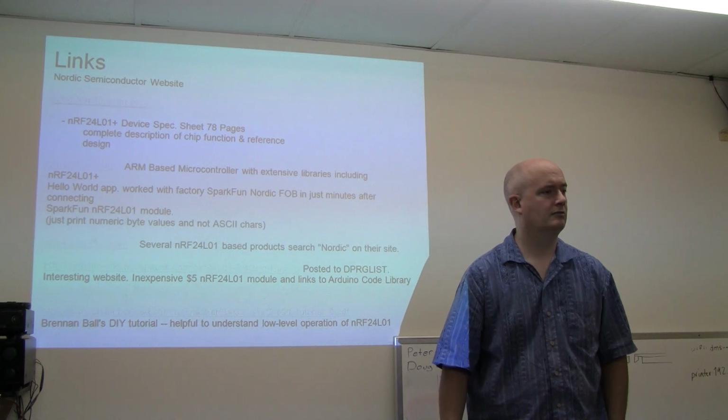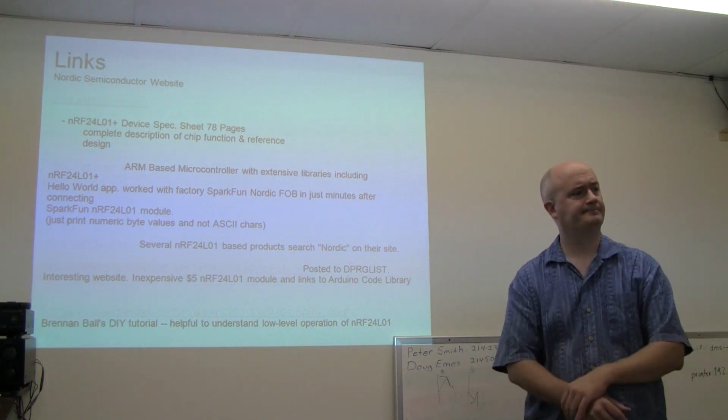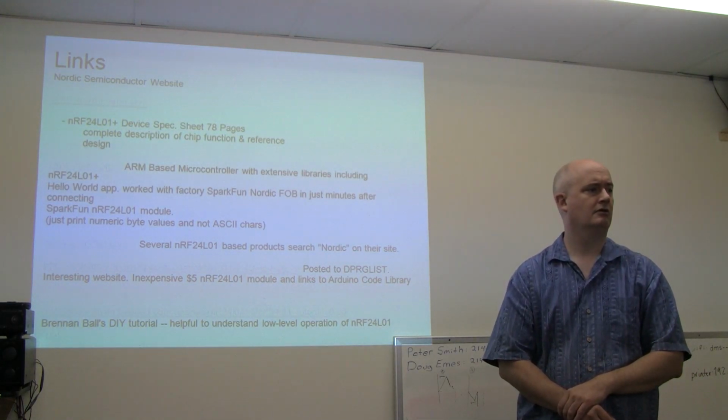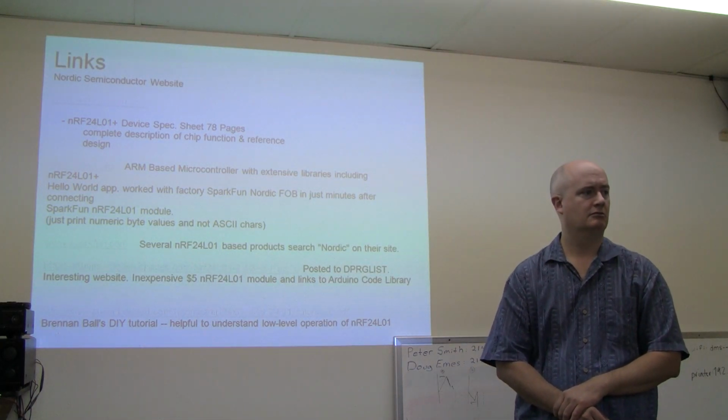And with the cost of the chip, the ones that are made for mesh networks will do multiple chips back to back. Two chips with a microcontroller in between them, with two SPIs. And it just moves data in between the two. And they're only about $7-8 if you buy them together. And so you can do 6 on both sides, if I understand correctly.